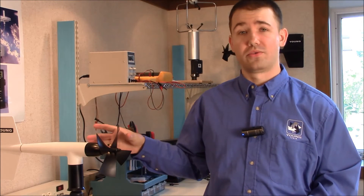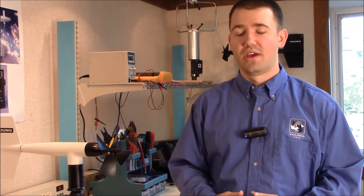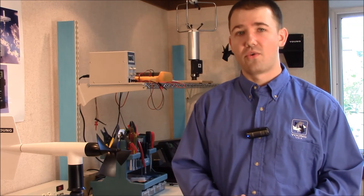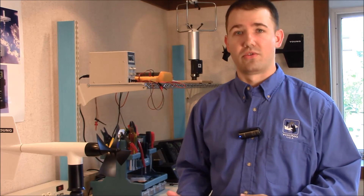We're all done. What many of our customers like to do is to just order a whole nose cone assembly from us. This way they can climb the tower, replace the whole nose cone, put the propeller on, and bring the old nose cone down to replace the bearings on their bench. Some things to look out for: the bearings should seat fairly tightly in the nose cone — if they're loose or they don't fit right, then you might need to replace the nose cone as well. Also, the shaft should be the same size the whole way across, all the way up into where that front bearing is. If that's worn away, it's going to cause problems down the road.